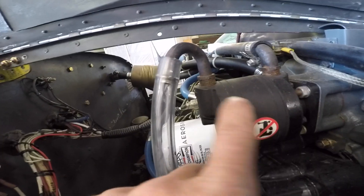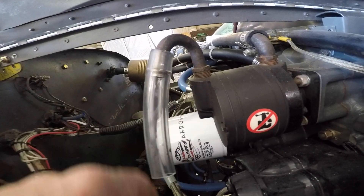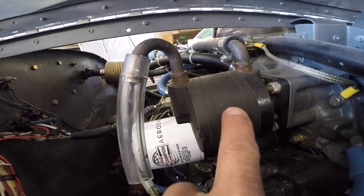The reason for that clear tubing is that as the vanes wear, the tube will begin to gray up — it'll eventually become almost a black tube, and that's all from the graphite that has worn out from the vanes.